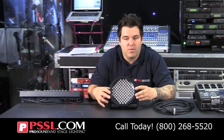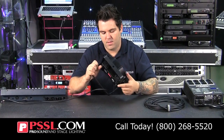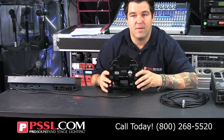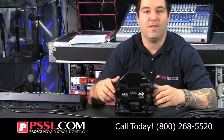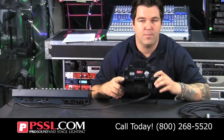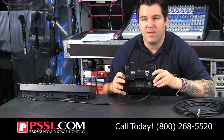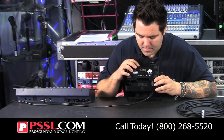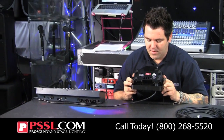When you have lights that use multiple channels, that throws a wrench in figuring out how to use them. Each light you use, you're going to have to give it an address. That address is basically giving the light a name. Here's the analogy: you, the controller, are essentially the teacher. Your lights are the class. When you want to talk to certain lights, you call them out and the lights raise their hand. If this light was called Bobby and I said I want to talk to the Bobbies, I would only be talking to the lights named Bobby, not the lights named John or Steve. So this particular fixture would be addressed at channel one — meaning it's the first light in my DMX address. This fixture has seven channels.